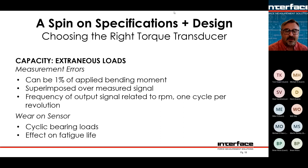We're going to talk about couplings. A torque sensor, just like a load cell, is designed to measure in its measurement axis — which in a torque sensor is a rotating axis, or about the rotating axis. If it has thrust loads on the shaft, those can cause errors and can also be damaging. Bending loads can be damaging too. Torque sensors have bearings in them, and those bearings can be ruined by extraneous loading. A bending load in the shaft will produce a bending-induced signal that changes with the position or orientation of the bending. If a shaft is spinning 60 times per second, you might get a 60 Hz signal just due to the bending.